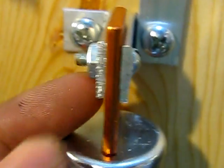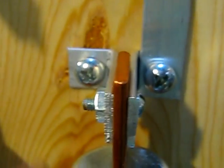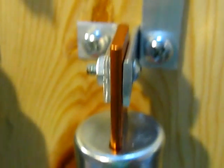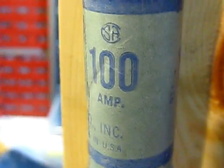These are removable but as you can see there is a nut and bolt right there so you have to unscrew that. It works pretty well. To join the switch to the fuses I used just another piece of 3/4-inch aluminum. I had to drill all these at once and then bend them, and the more I did it the more errors came around — after you do something a whole bunch of times it's really easy to screw up. Then the mechanical lugs down there again and the fuses — so that's basically my giant switch.